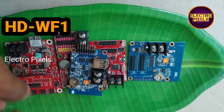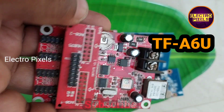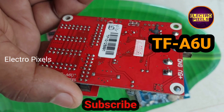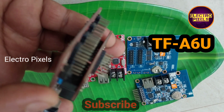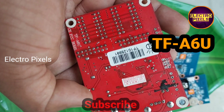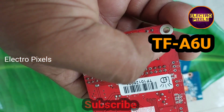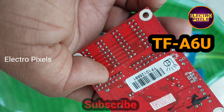Now let us discuss about the last one, named TF-A6U. This is the old model LED driver controller board used in earlier days — this model is now outdated. It supports multi-area displays, colorful borders, and U-disk program updates. It also supports at most 200 programs; each program supports 16 partitions for simultaneous play, and each program supports 200 messages. It also supports many color borders and picture borders, and file formats including GIF, SWF, BMP, and JPG.